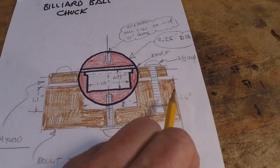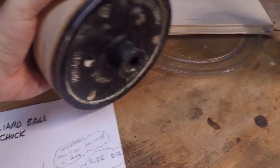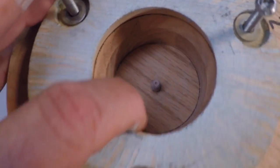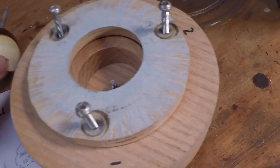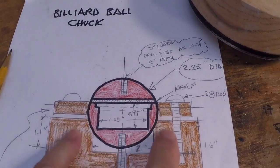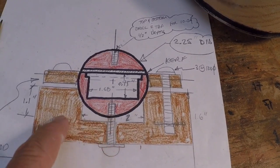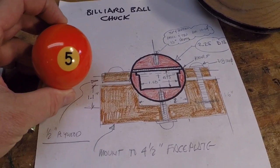I ended up making a chuck for this. It's mounted on a faceplate, and the ball is first attached into the chuck using a 10-24 screw that comes up through the bottom and grabs a hole in the bottom of the ball. There's a flange that's cut to hold the ball in place — it puts some downward pressure on the ball and keeps it from spinning. It's got to be pretty tight. When you're coring these things out with Forstner bits there's a fair amount of friction, and if it gets too high you can actually spin the ball in the fixture, which results in extra cleanup on the outside.